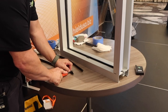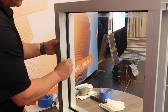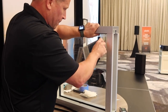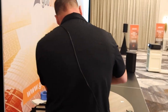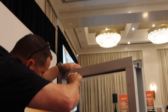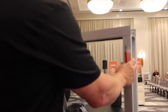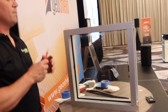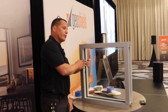So right now, normally I have backer rod. Just think about that as a backstop — that's going to help you have a compressed bead when you do this. What I'm doing right now is I'm pinning the window. This window has moved in shipping. I think UPS or FedEx, they like to throw things around. So normally when you have a seal that you put in, you would put in a backer rod. So for demonstration's sake, we'll act like all the seals are out. We have a backer rod in. Backer rod is like a backstop. You can actually cut the seal flush — it can stay in if it stays inside the channel and it leaves that positive pressure on the exterior seal, you're fine.